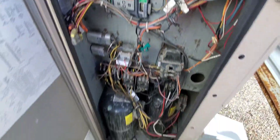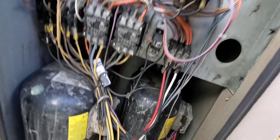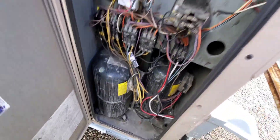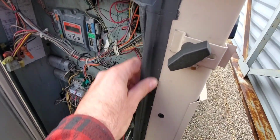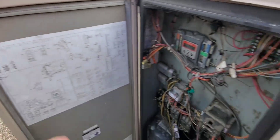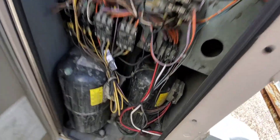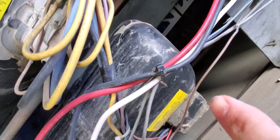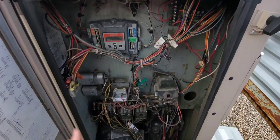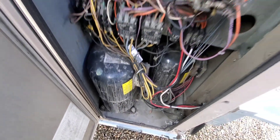The economizer board is right here, and you can see that this unit has suffered some water damage. What happens is the blower section over there has no divider plate, which puts the whole electrical section under a negative. Somebody has come along and put these on, and there's a gasket here. But these York Predator units — the older ones — don't have blank-off plates where the filters go. There's a negative here all the time, and it can pull in water over time. You can actually see how water's been running down this compressor, and when it rains, it just gets sucked in.